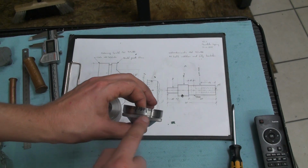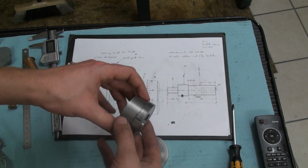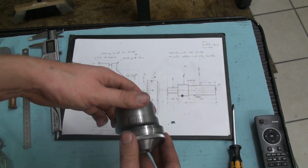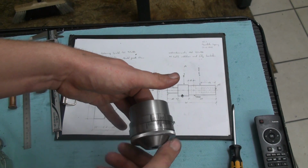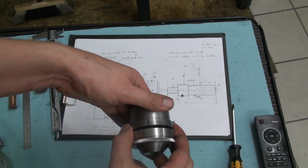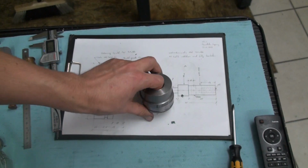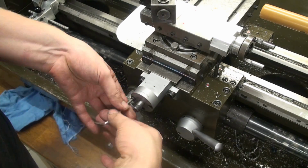The engraving will look exactly like my sketch here, and this is the bearing block with the vernier ring, and this will go together like this. This part will be spun, and this ring here can be adjusted to set 0 if you want to do minor adjustment without moving the actual dial. Okay, and just to show you where it goes on, we pull off the handle.